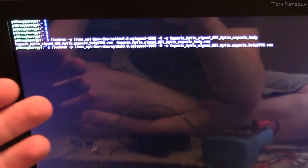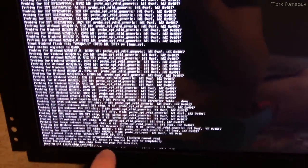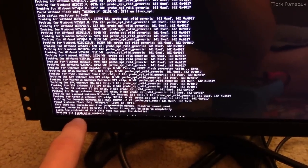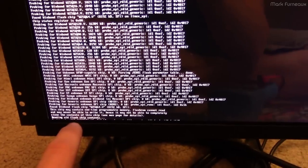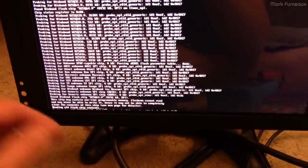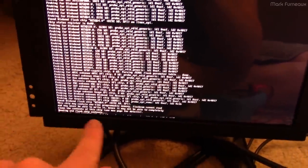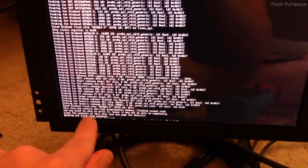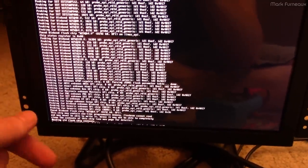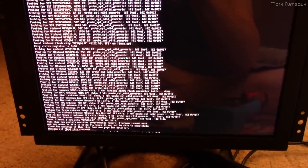Back at my Raspberry Pi, I've now switched from a read command to a write command — just writing that ROM. It's going to read the old contents, figure out what needs to change, erase the pages, then rewrite only the pages it needs to in order to update it to match, and then verify by doing a readback of the chip to confirm that what it wrote is actually on the chip. You don't need to manually verify the output. This is going to take even longer than reading the chip did, so I'll bring you back when it's done.